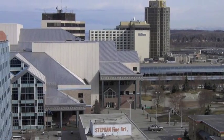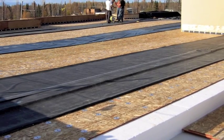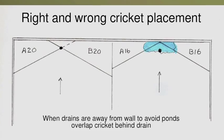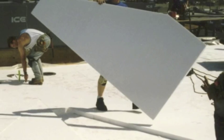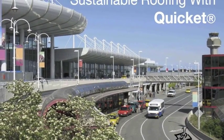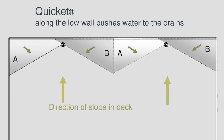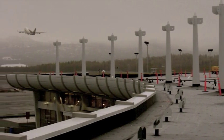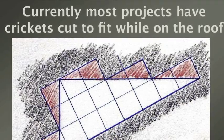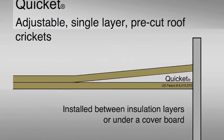All consultants have to be concerned with attachment and fire ratings. As long as the cricket is covered or sandwiched in between ISO or cover boards, then it has a perfectly acceptable use in a fire rated assembly. Consultants are usually quite conservative, but when new products come on the market and they see the advantages, I see no reason why it shouldn't be considered.